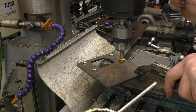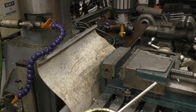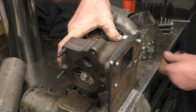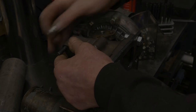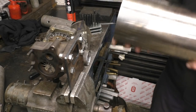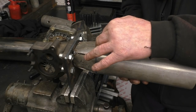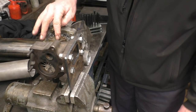That's going to make sharp edges on the holes. So this plate is now going to give us a good solid mounting point to mount the turbocharger onto. That's kind of how it's going to be - that's the mounting for it. The burner can goes onto there with the flame tube inside, and the burner can is going to be starting here. The compressor outlet from here comes around into the burner can; that's the oil feed in.